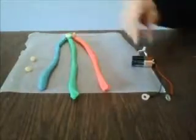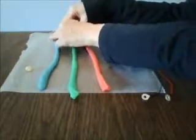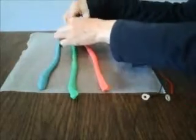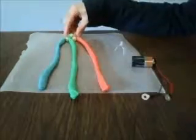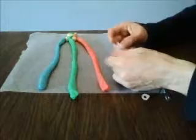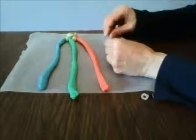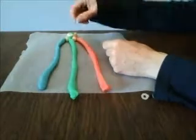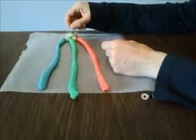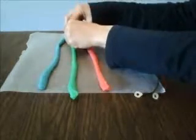Because the LED is kind of small, I'm going to use a couple little balls of the resistive dough in between the different colors of conductive dough to prevent short circuiting. And that's pretty much our setup with the dough. We're going to take the LED and bend the common cathode to the back and bend the red, green, and blue anodes so that you can stick the cathode in the circle of dough and the red, green, and blue anodes in their respective colors of dough.